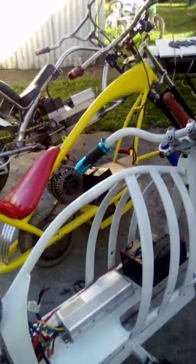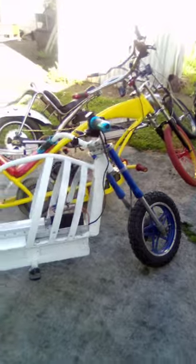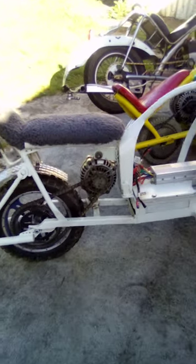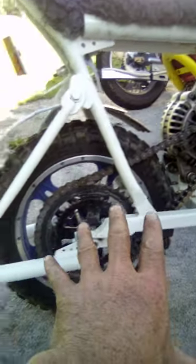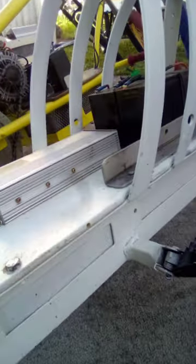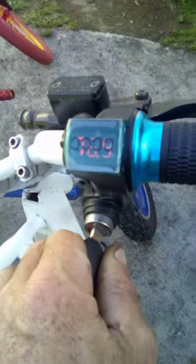So what I'm going to do today is actually just look over three alternator bikes, guys. This is the first one, the alternator carcass bike, which has a 55 amp alternator in here. I'm just sort of brushing over stuff. It's got a 1000 watt controller, 72 volts. It's 48 volts, but I've ramped it up to its max. And two little batteries to run the mag, two 12 volt batteries, ramped up to 24 volts.